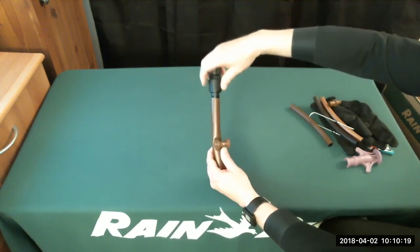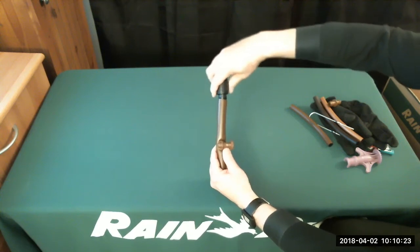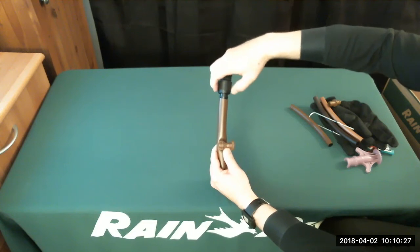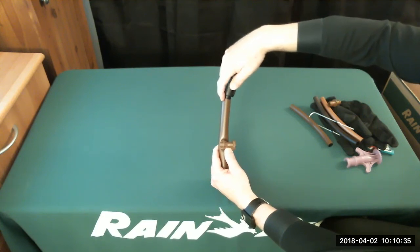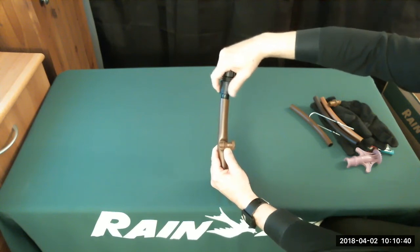Also, how do these go on? A lot of people know what twist lock fittings are, but they don't know how to put them on. So you want to explain that you do a rocking motion and demonstrate how that will go all the way down inside. And then you go clockwise, and this is going to tighten down on the outside of your QF header. So this is your twist lock.